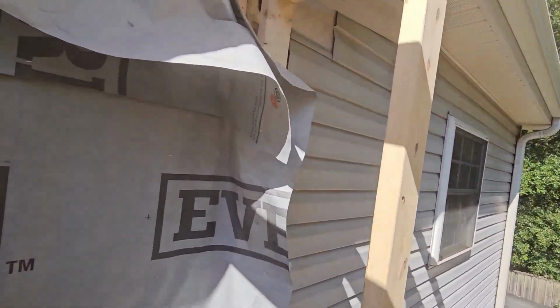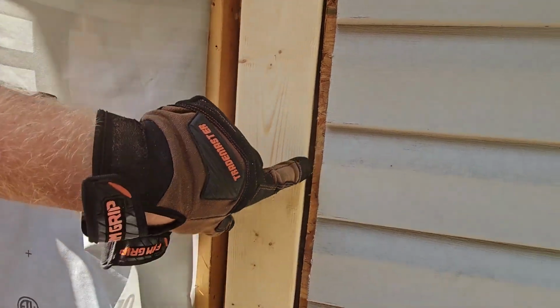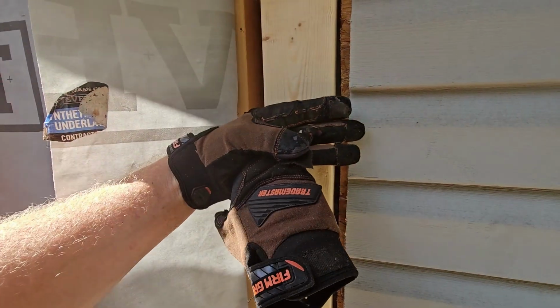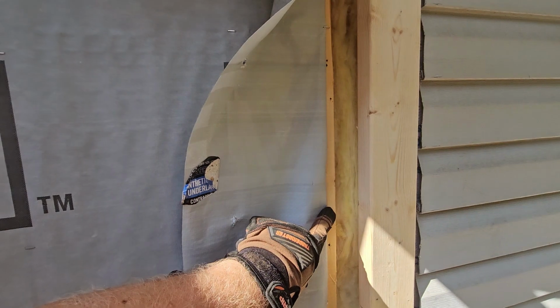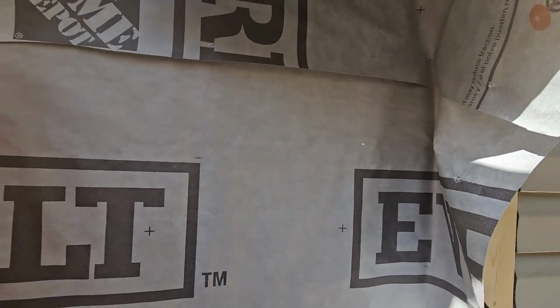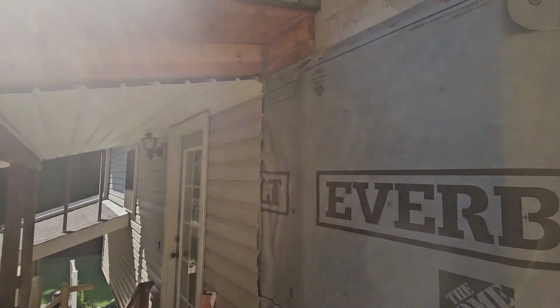That first post, the little post I did, where basically I just nailed that other one behind here, was so that I could skirt it back through there to add support back behind this, because there's none there anymore. I don't really need anything on this side because there's a stud right here, which is plenty close enough for sheetrock support or whatever, Durock, depending on if it goes with tile or whatever. So that'll be perfectly fine.